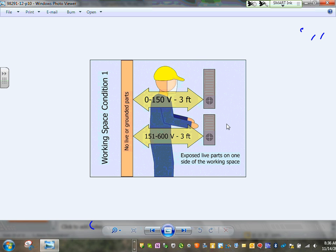And of course, you have to have a light in the electrical room, and the light has to do what? Have no auto control. And the door to the electrical room, the large equipment electrical room, has to have panic bars on it, so when you push it, it will open by itself. I don't think I forgot anything, guys, here. So please, this is a very, very important topic, guys.